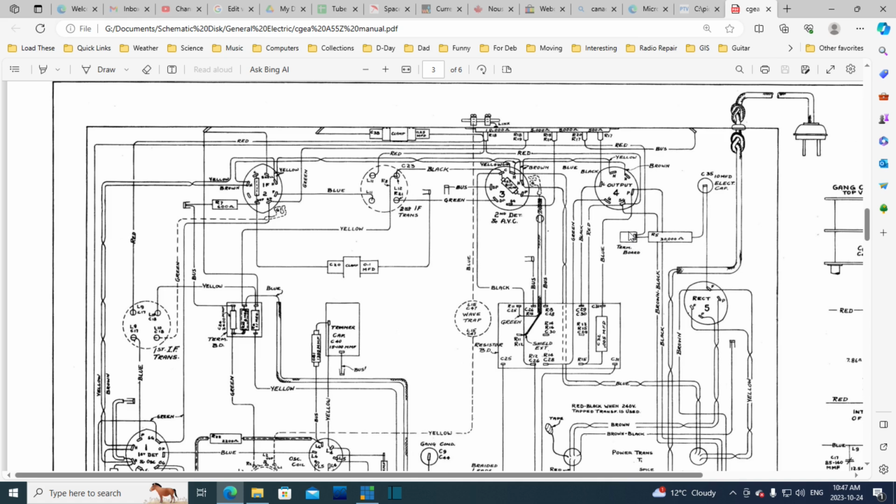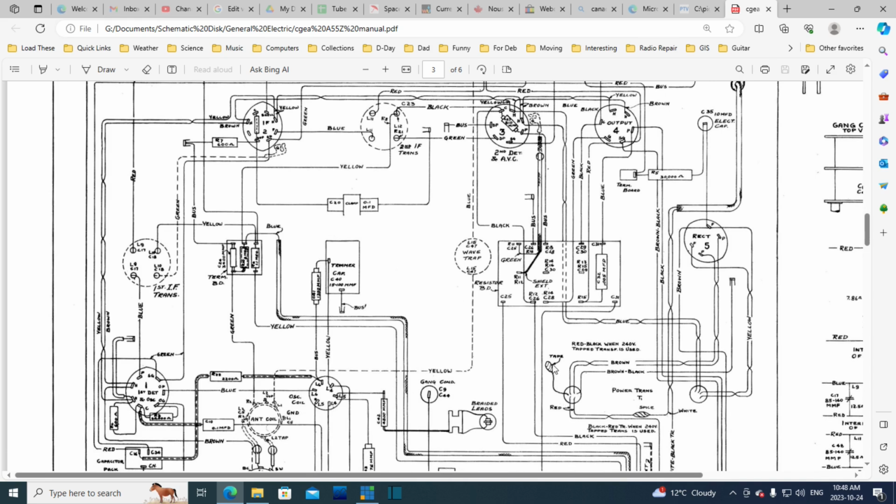The terminal board, is it sitting in there? Wow, I don't see one anywhere. But here's that board with all the parts on it. I guess I could have reassured myself using this earlier. I'm thinking like three different things at once here. If I'd used this diagram earlier, I could have recognized the run of the wires in this area of the radio better. Figured it out anyway. Look at this wave trap in dotted. Oh, it's up on top. Wave trap up on top. Well, I won't look for that right now. Here's an interesting thing. Look at this. This wire comes out, and then it's just a lump taped. That's kind of odd. They're actually showing the splice here.